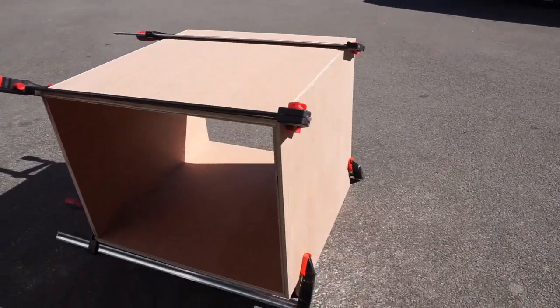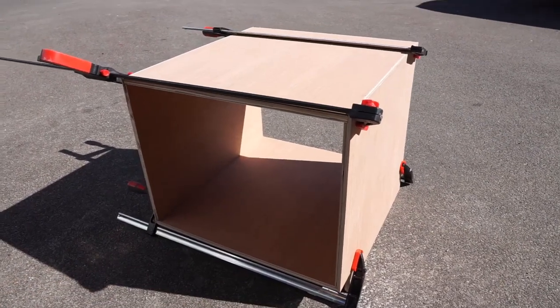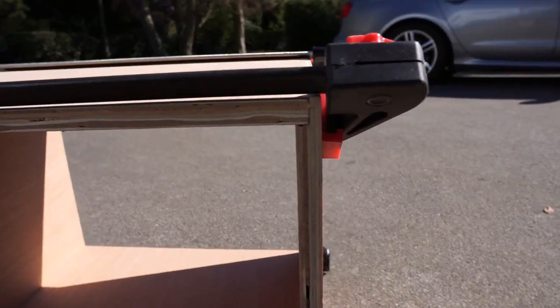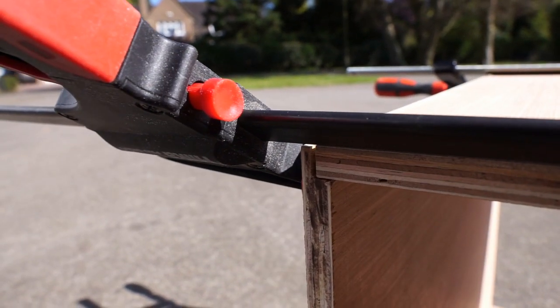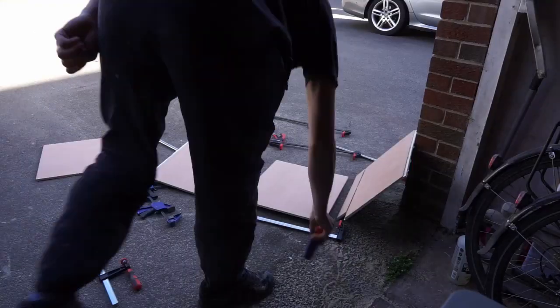Yeah, this is our mini cabinet, which is going to sit just beneath the oven, and then we'll have a big drawer. I'm going to glue it and maybe put the odd screw in, I don't know. But if you see, I just routed out the tops using the 12mm router bit. So then the top fits on really nicely. And then I routed out a 12mm gap for the base to sit in. So hopefully it should be nice and strong.